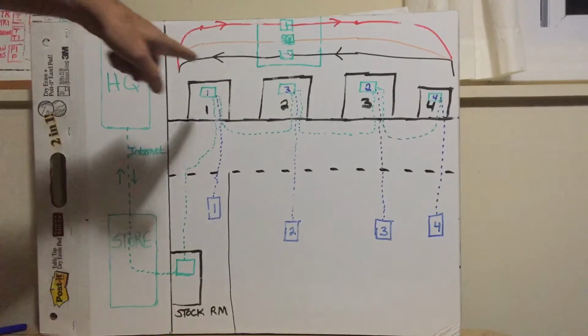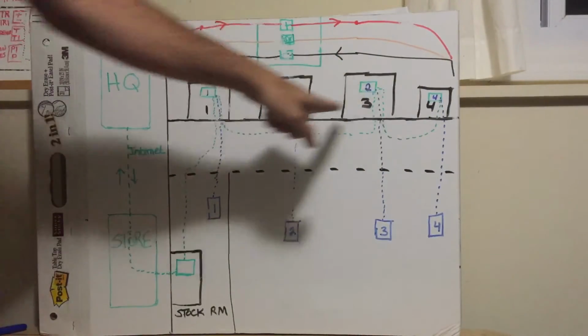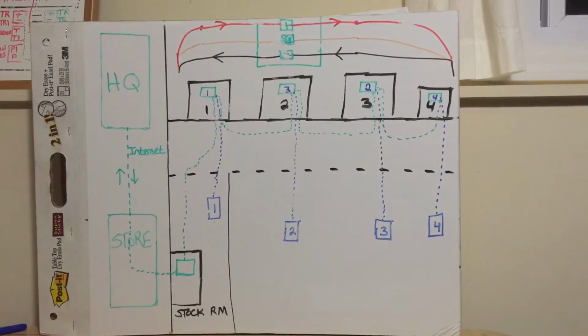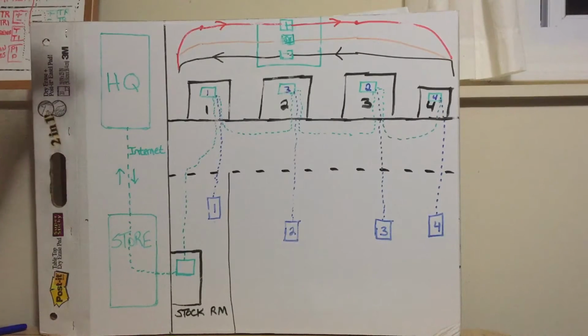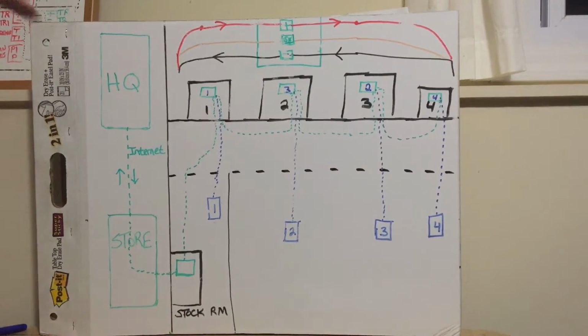This stuff is difficult, but if you have unit number 1 and 2, but you don't have COM to 3 and 4, you've got a wire broken or something disconnected between 2 and 3. You can just use process of elimination, guys. You just got to break it down into the simplest terms. The problem is we don't know how they ran these cables. Target can tell you this. Target has blueprints in most of their stores, and they can tell you which units are in which chain, which chains have a diag in them, or a repeater, as many guys call them. But this is hard to figure out sometimes. So there's a little bit of time spent, but it's not impossible. It's just time consuming. So with all that said, everyone, that's the basics of the system.